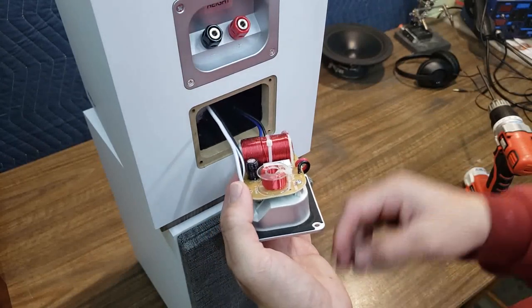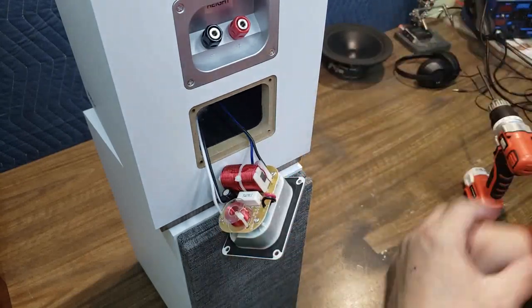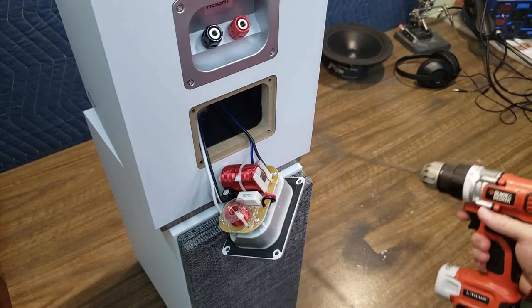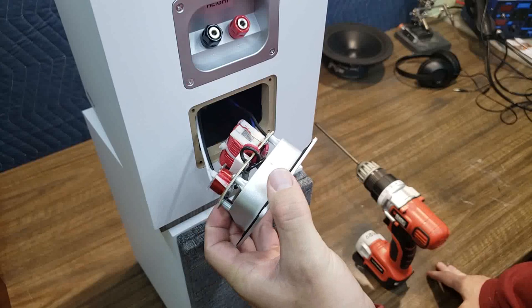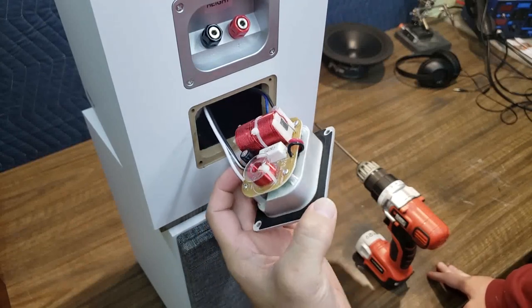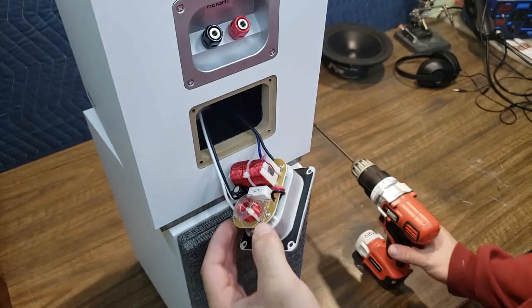You can get away with doing just a first order on the woofer because its physical mass is going to prevent it from wandering too far. But I would still rather have at least a second order on the tweeter. Right now, the way this sits, the Sony SSCS5s and the DCM and the Pioneers all have arguably a more robust crossover than this.